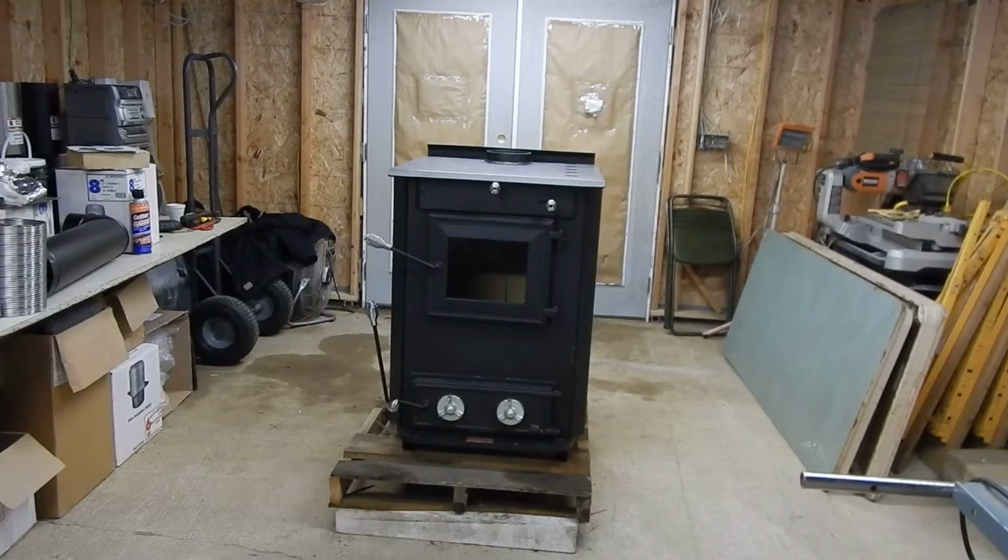On the back of the stove there's a bimetal regulator, which you'll probably see on the 160, the 75, and some of the other stoves as well. It's also on my website, MessickStove.com. There's information and some diagrams showing you the DS regulator, and it's bimetal. Basically, once the stove gets to 400 degrees, if that's your running temperature, you will dial that down, close it so the chain is taut and the flap is sitting flush.